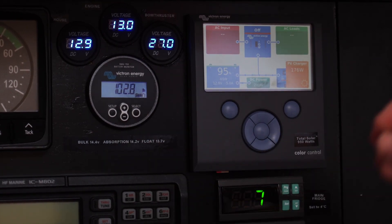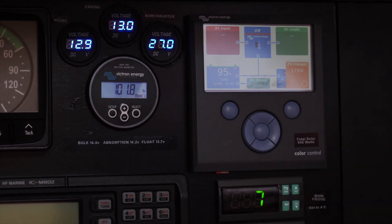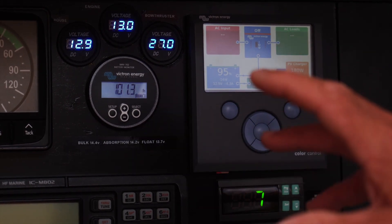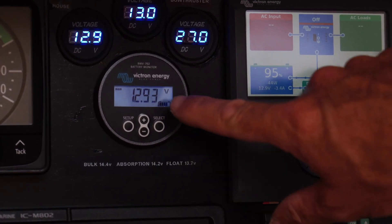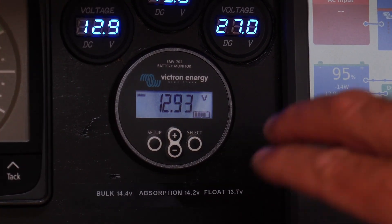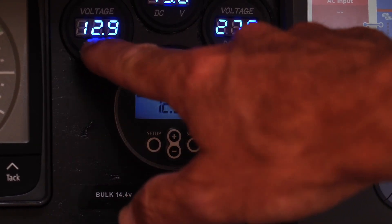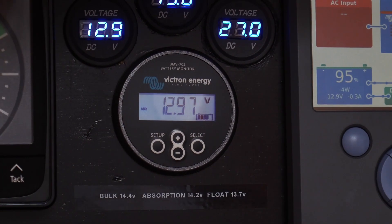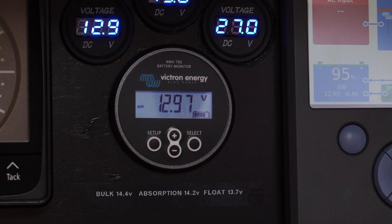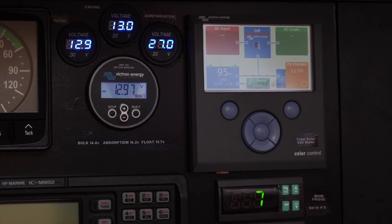This screen shows the hours remaining. At the current draw-down rate from the batteries, this is how many hours the battery bank would last — 102 total hours. This assumes drawing the battery bank all the way down, which you would never really do for the health of the battery, but it's a reference point. Here's the voltage — the display says 'main,' which means it's monitoring the main bank, in this case the house bank. We've got 12.94 volts, and you can see that matches the voltmeter up here at 12.9. The auxiliary input shows 12.97 volts — basically 13 volts — for the engine starting bank, which agrees with that voltmeter too.